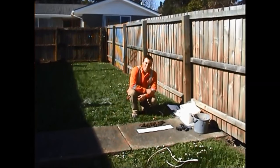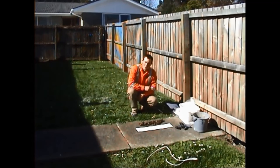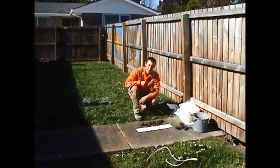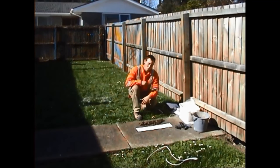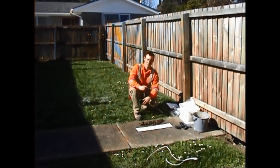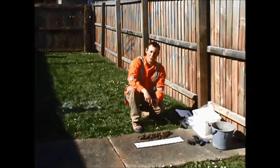When you're doing a hand auger, it's pretty good practice to line the core out along the ground. This makes it easier to log it once you've done your run. It's also good to take a photo — you can do this by filling out the board and lying it in front of the core. When you take a photo, it's good to look down on it rather than from an oblique view.